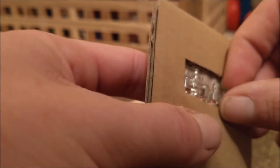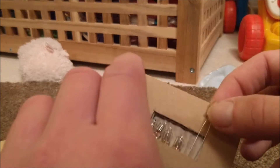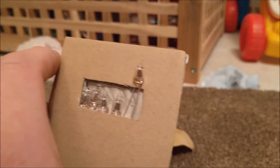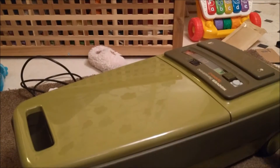The economy light and bag full light are run by these — they are glow light indicators, the precursor to LEDs. I'm hoping the economy switch one has blown, because if not I need to look at the resistors, and I'm not very good at that. They're very cheap so I thought I'd try them. They are different to the ones fitted, but I'm hoping it's just 30 years of miniaturisation. I have my soldering iron out.